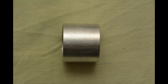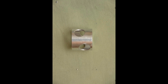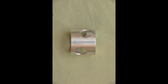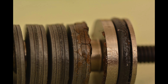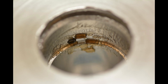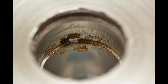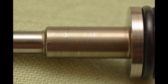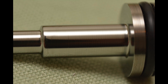This is the pre-chamber spacer and because it's made from thick aluminum I drilled it just to gain more space. It's just a little bit but it's something. You can see the washers — how dirty they were, with thick grease. I took them out, cleaned them up, and put very tiny silicone oil. I polished everything — once and again and again until I had these results.